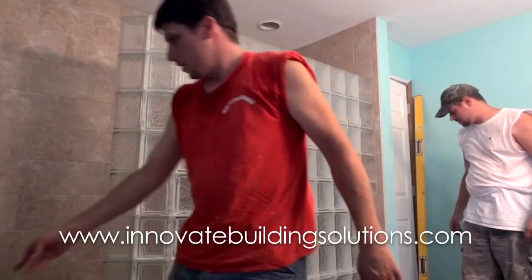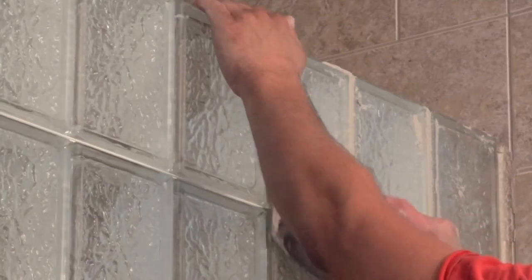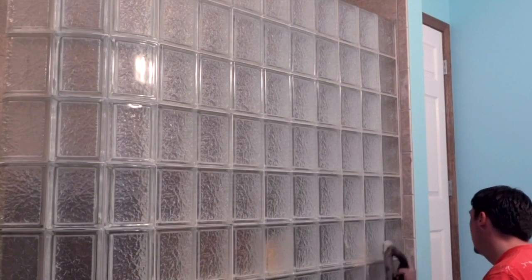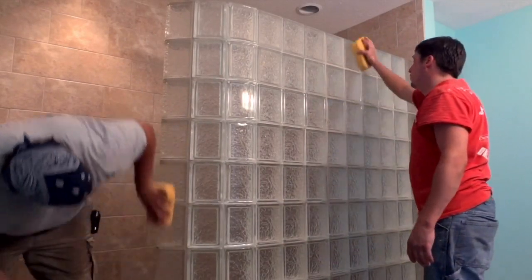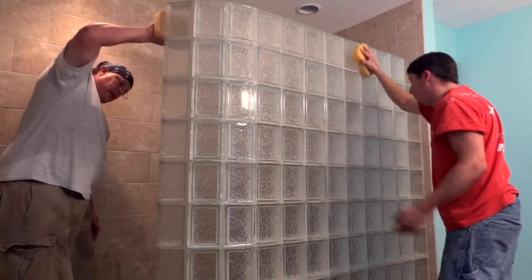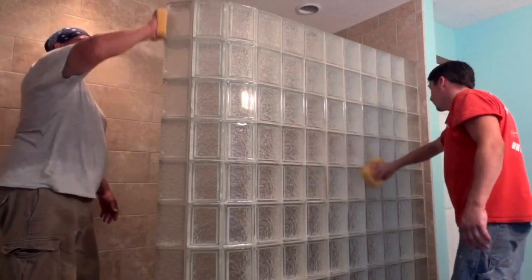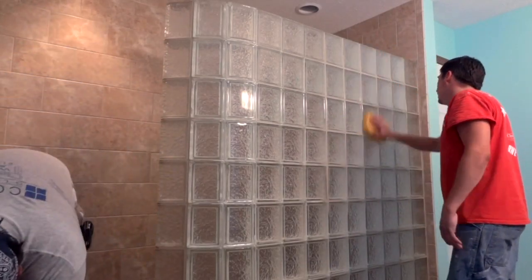The wall is now completely installed and after waiting a few hours should be ready for the grouting process. If this is your first glass block wall installation, or if you're unsure of yourself, it may be wise to let the silicone joints cure overnight and begin grouting the next day. Since silicone is a slightly flexible material, the wall will have a tendency to sway until grouting is completed, so the extra curing time should come in handy for a beginner as the silicone will be more adhered to the wall joints when grouting begins.